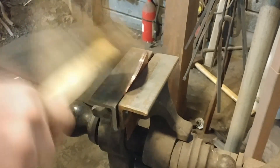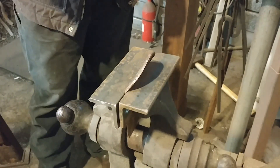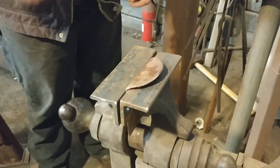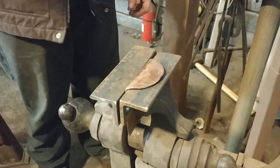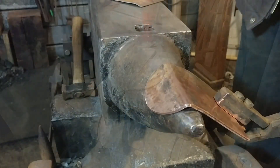After that, we're going to take the simplest part first, which is the spatula. All it requires is to be clamped in a vise with really sharp edges to create a crease at the bottom end of the radius. We're going to start there first and bend it at exactly 90 degrees.